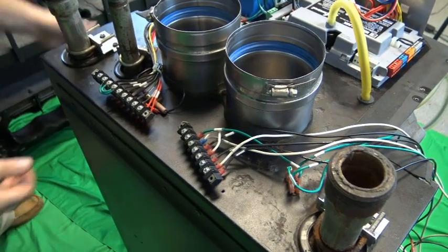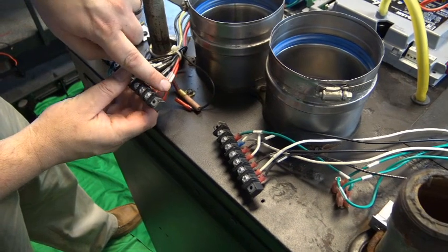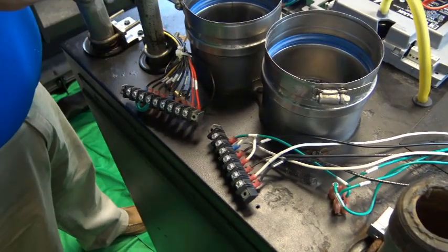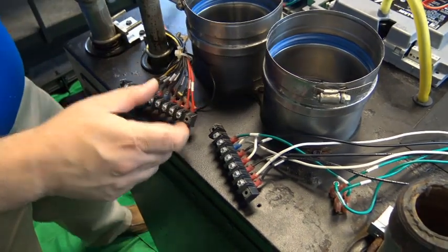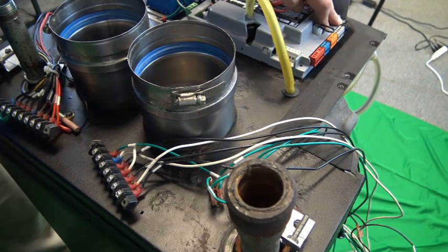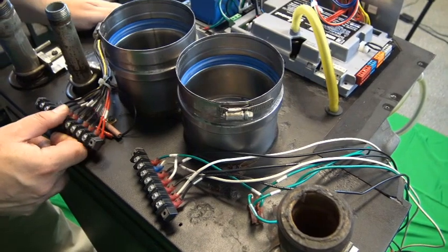At this point, we will have to follow the wires. These first two wires go to the outdoor temperature sensor. We will cut the other end of the wire and then bring it back to the corresponding position on the U-Control as shown in the wiring diagram in the instructions provided.